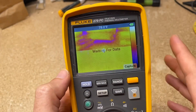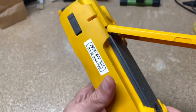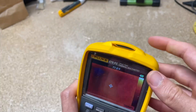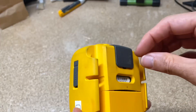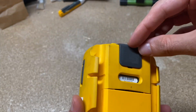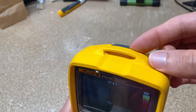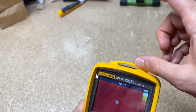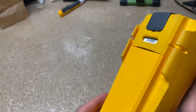Really cool little multimeter with the thermal imager built in. Customers really like this form factor. One thing a customer asked recently was about a T-pack or the magnet packs — will it work with this? It doesn't have the typical half-moon cutout like other multimeters, but this little strap right here — you just run the Velcro cord right through the strap and through your magnet and you're good to go. So yes, you can use a T-pack with this tool.